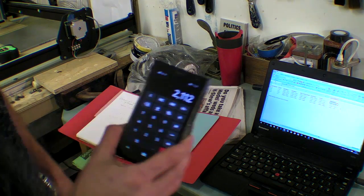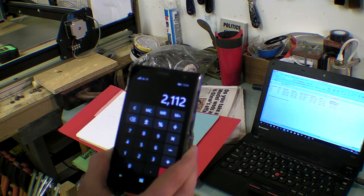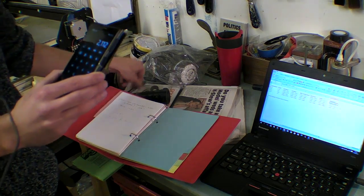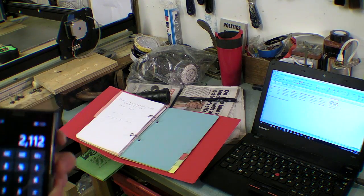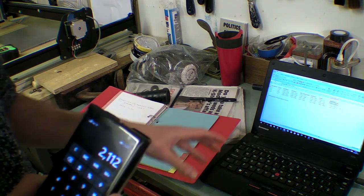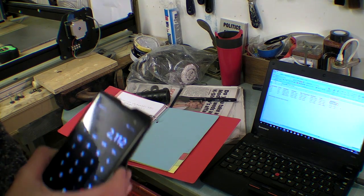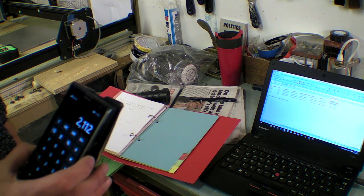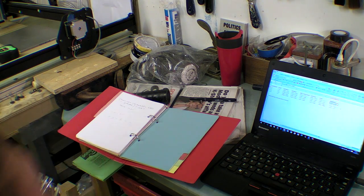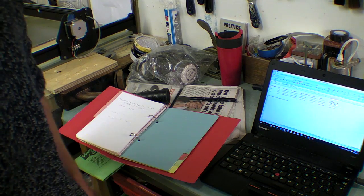Supposedly my feed rate on this machine should be able to go at 2,112mm/min. So I'll round it down to 2,000 and use that for the test. I'm hoping this was a conservative equation — I borrowed it from Make magazine or something like that. I'll provide links in the description below.